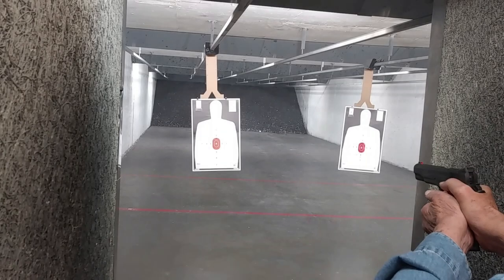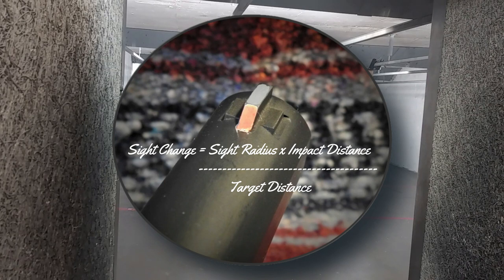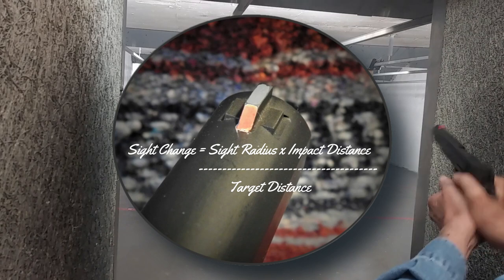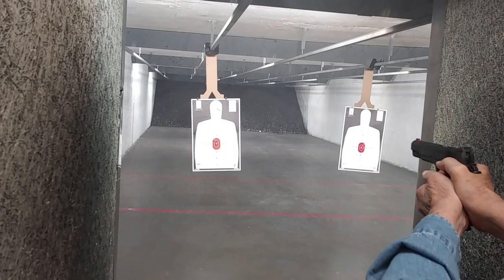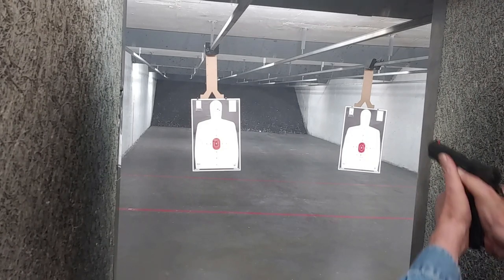As I mentioned earlier, I had to shave off some of the front sight to adjust the point of impact. Using some mathematical calculations, I determined how much material to remove. Luckily, I only had to remove the front slope of the sight — the front sight on this particular model had a slope to it, so I only had to make the front sight level to accomplish what I was looking for. POA equals POI at a combat distance. The Rock is now a point-and-shoot affair: place the front and rear sight on what I want to hit, squeeze the trigger, and hopefully hit what I'm aiming at — normal caffeine-induced shaking hands notwithstanding.